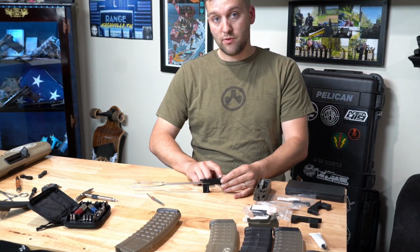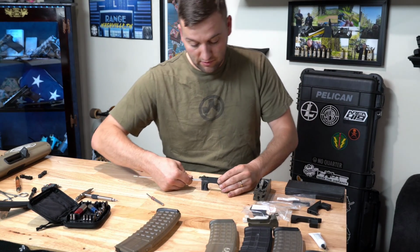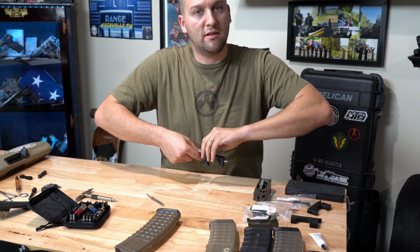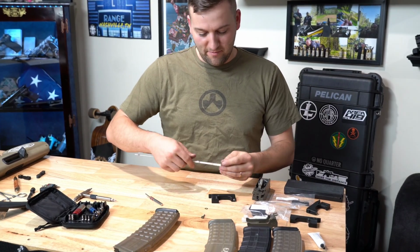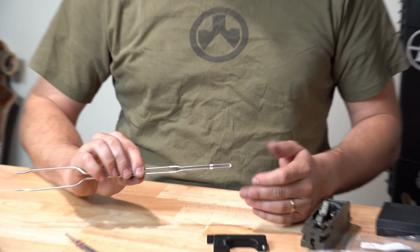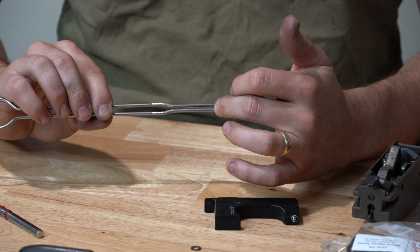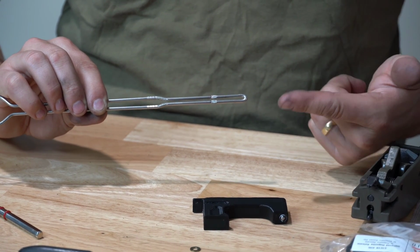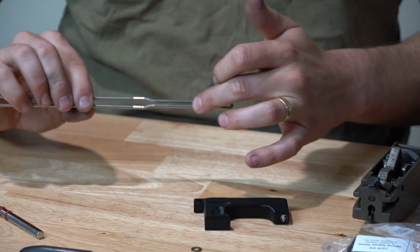This final set screw is not meant to be a clamping screw. All that it is supposed to do is reach down. It's in there pretty good. Oh, because I took the nut, the screw in there. Gotta take that out of there. All right. These two flats that are on the linkage bar, this set screw is simply meant to contact and engage those flats. So if for any reason this side fails, you're still going to be able to press and pull your trigger by that set screw engaging those flats and pulling it to the rear.